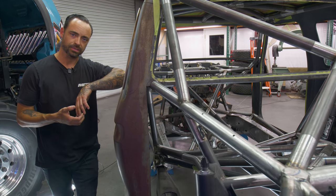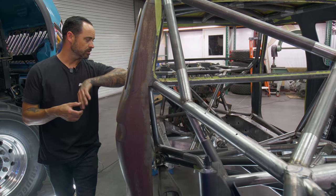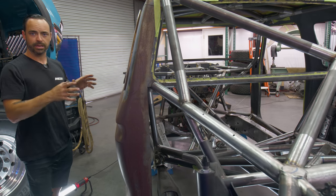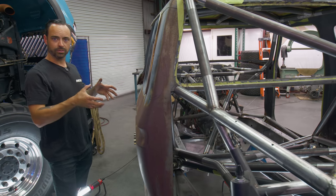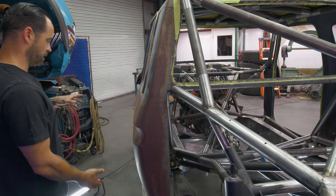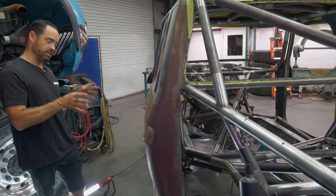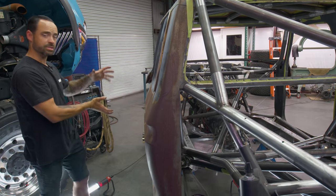Everybody's got their own opinion on stuff like that. I've kind of used a tried and tested height and spread on lower link and upper link that you can incorporate as long as you set the height in the right spot on the frame. That is really a proven recipe for success for handling dynamics. So what we did is we built all plate boxed pivots that were designed originally to go into the frame, so the height and stuff was proper as far as their design.